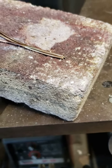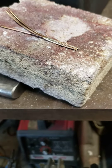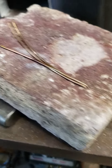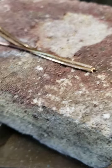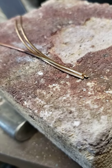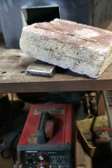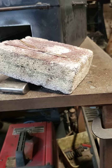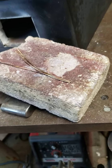I'm doing a bronze wire CDA 521 fusing demonstration. I've got three wires cut to approximately four inches each — this is 0.062 material in inches — and the three are stacked in a triangle, bent into position to keep them together. I have the fire brick on an angle, about 15 to 20 degrees, and the part I'm going to fuse is at the downside of the fire brick.